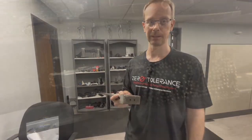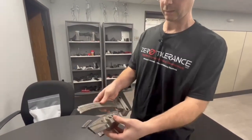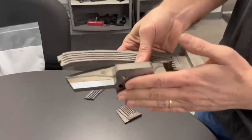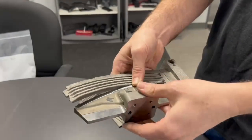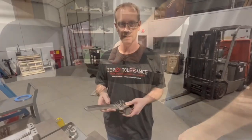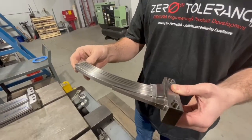Here's where we're using the wire EDM as a saw — we're not after accuracy, we're simply after speed to get this cut off the build plate material or supports. This is another example of a slide that we had printed. Here's basically how it was: this was the build platform, and then this is something we were able to machine in our five-axis machine. When we were done with it, we wired this whole entire thing right off and that gave us our slide. I wanted to show you the very finished product for that 3D printed slide after we did all the wire work, benching, and polishing.